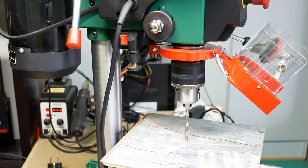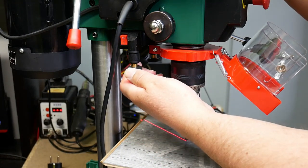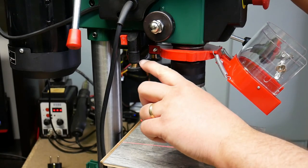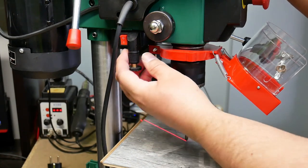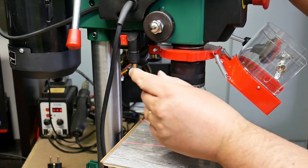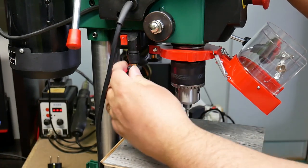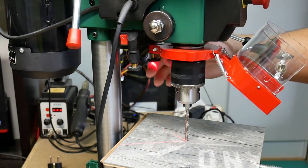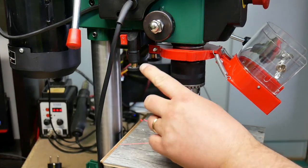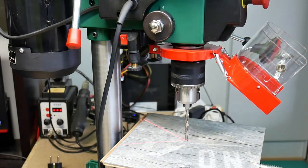The first thing is about lining the laser up. On my unit, we're supposed to move this knob to adjust the laser, but this part here, which tightens down on it, was too tight. So when I turned this, it wasn't actually turning the laser. One needs to loosen this first and then adjust it, then bring this to be more tight and fine adjust the laser. Now it seems to be working okay.